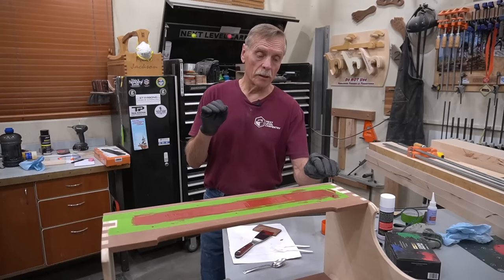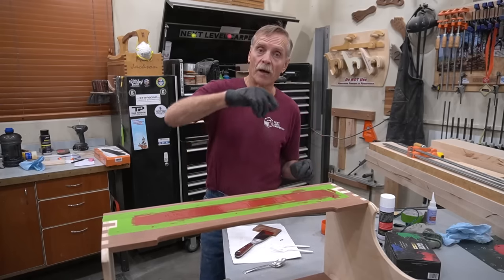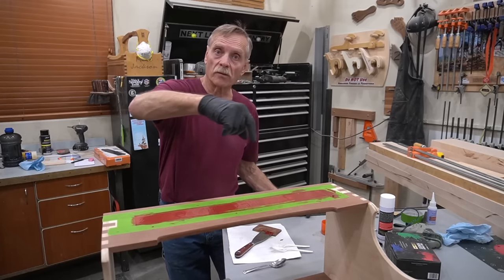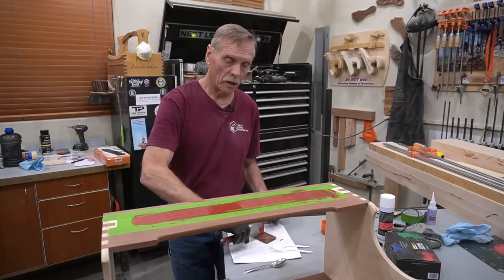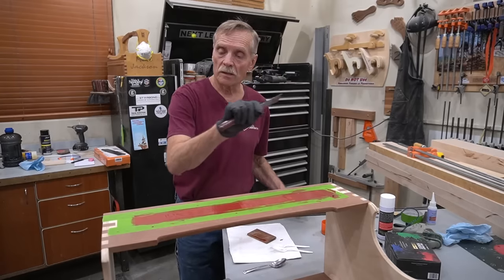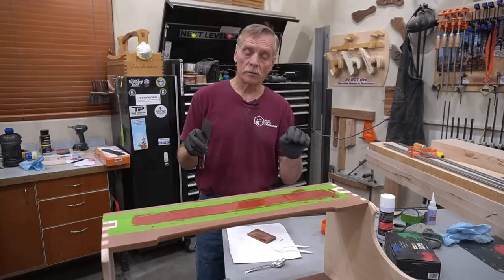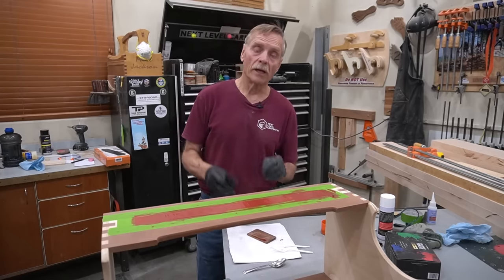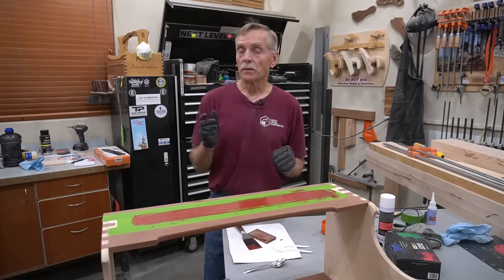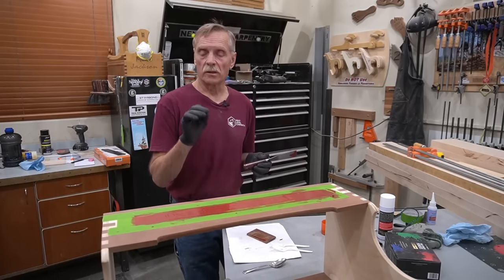And I'll point out quickly here, before I go to cleaning up, that the thickness of the masking tape actually acts like a screed when dragging the putty knife across there. The knife is wide enough to span it, and that leaves just a little bit of a film of epoxy proud of the wood, so that I'm sure the letters are full when I peel the tape and clean up the epoxy. So I've got to do the dishes here, and I'll come back to this after it sets overnight